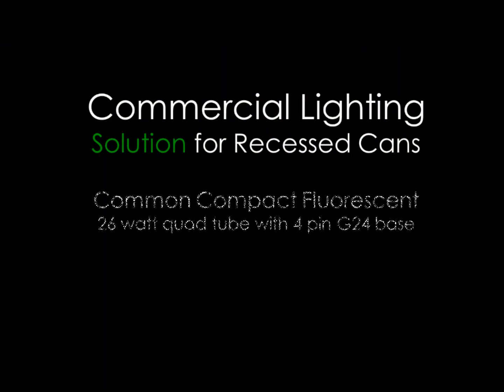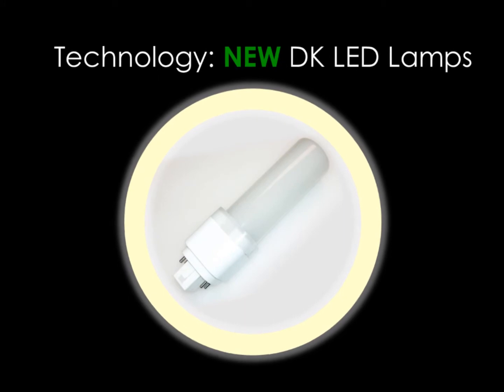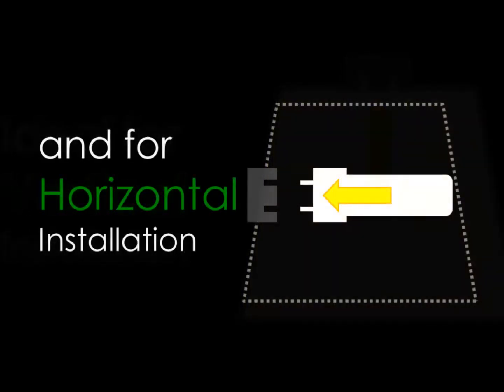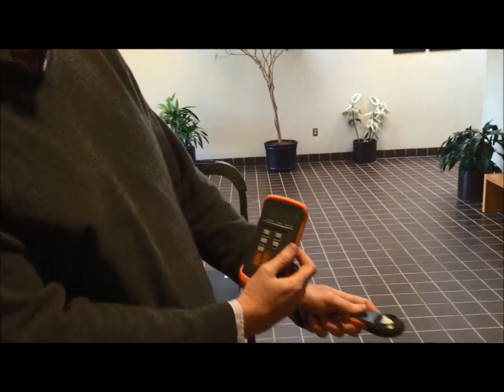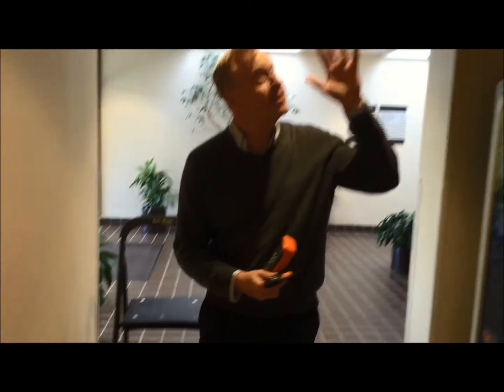We're here to compare the new DK LED plug-and-play G24. There are many types of G24s. The one in the ceiling here is the 26-watt, and with the four pins, it typically, in this color temperature, is going to have something in the nature directly under the light of about 16 to 17 foot candles. This is 26-watt at 2700 Kelvin.